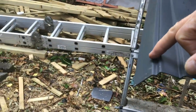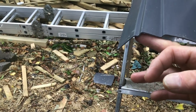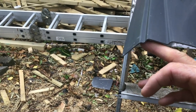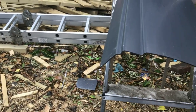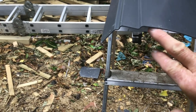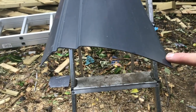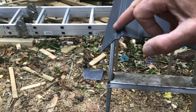essentially what happens is the rain drips down here and it will attempt to crawl back up here. But you've got a little ridge there. Initially it'll drip down there, so it still won't hit the wood. And if it creeps back up there, you've got another little ridge there, and again it'll drip off. So the rain will drip away before it actually hits the wood, which is just here. That's where the wooden cladding will be. But the rain should not hit it at all. The felt itself, or the roof underlay, sits on the top and just rests down to there.